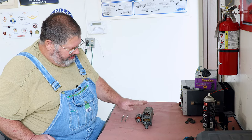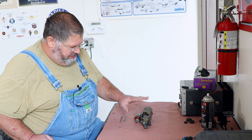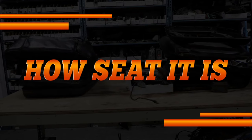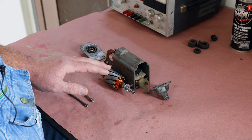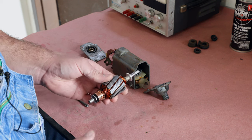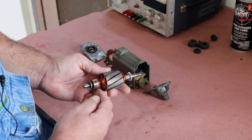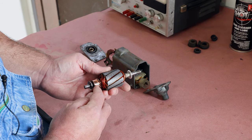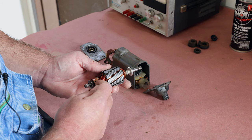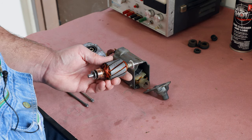I got the motor taken apart and ready to go back together. Now I've put it back together and it's been run — that's why there's marks here on the motor. I did put this in my lathe, turned the commutator down, and cut the micas.